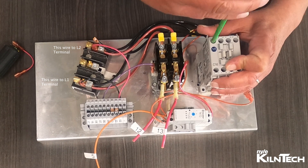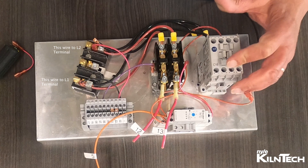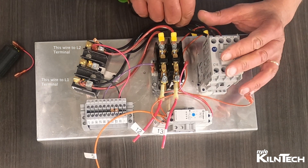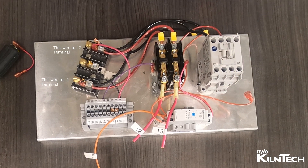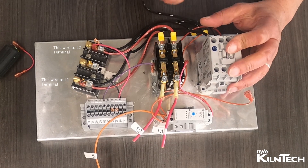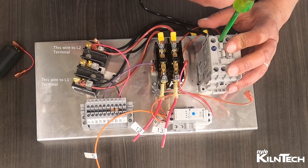Go to L1. Now when you're looking at this wiring, L or T means power or volt amperage, and A is control. That way you know if one's going to carry any real load of power. It doesn't mean you don't want to be careful — it just means you'll know what's going on at that spot.